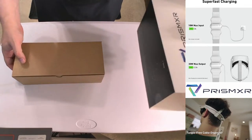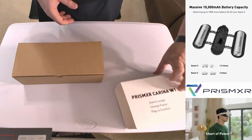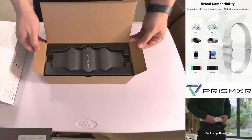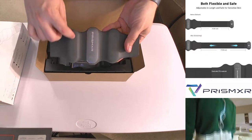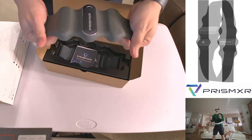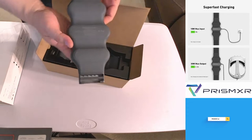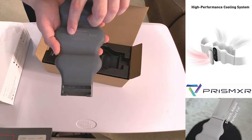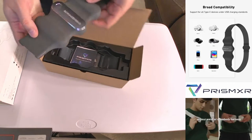I'm looking forward to doing another marathon video. On the back you can see 'Carina — Empowering Your Virtual Journey.' This is from their Constellation series of accessories — their first run. It comes in a brown box, and inside I've got the black one. It comes in white and black. It's got some heft to it because it is 10,000 milliamps — there's a 5,000 pack here and a 5,000 pack here, plus a power button. It looks like it's coming at 50% charge and has a little bit of flex to it. On the bottom: input is 5V 3A, 9V 2A, 12V 1.5A; output is 5V 3A, 9V 3A, and 12V 2.5A, which gives you the 30 watt max.